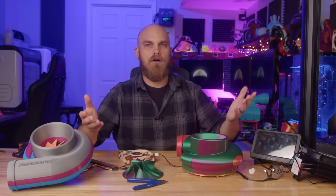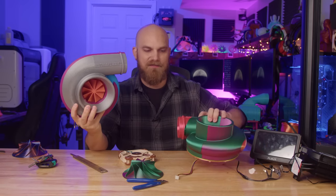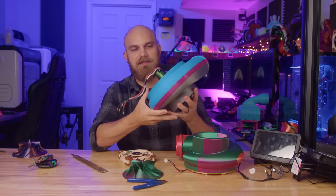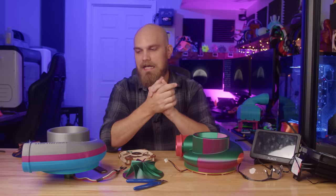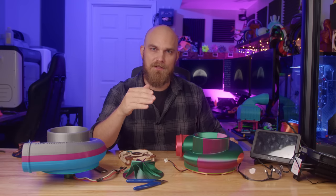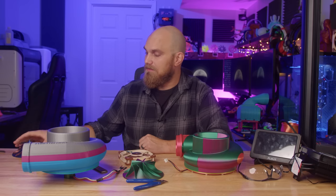Once the power plant is done, print out all the other pieces. You'll need the back plate, compressor opposite, housing opposite, gasket, adapter, adapter gasket, and hold down. I say 'opposite' because I mirrored the initial model since the fan spins in a different direction. I printed everything in PLA except the gaskets, which are TPU — make sure you print the gaskets in TPU for best performance and proper clearance. I also printed the compressor in a new multi-color filament by a company called Texanar — I'll leave a link below.